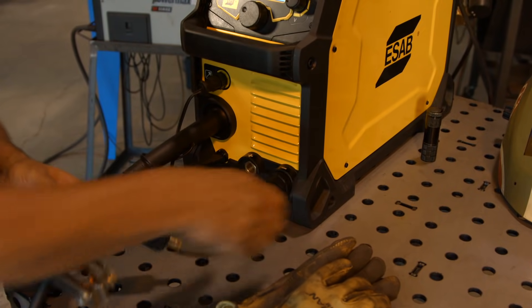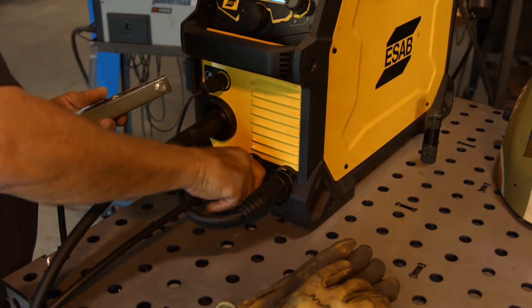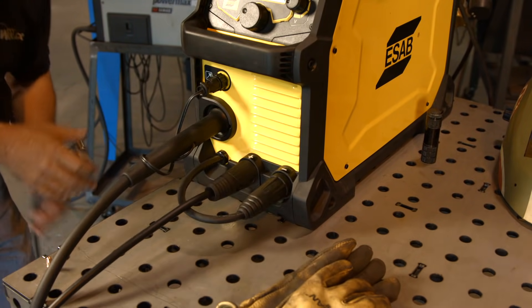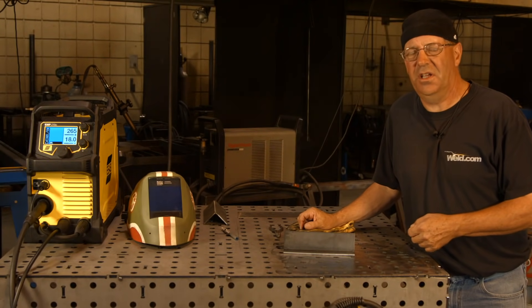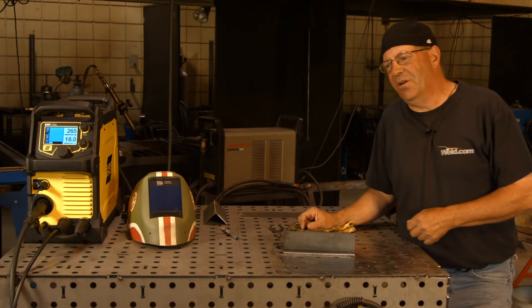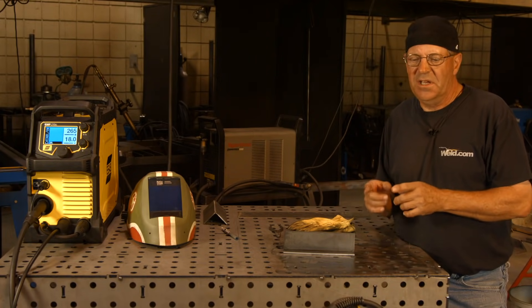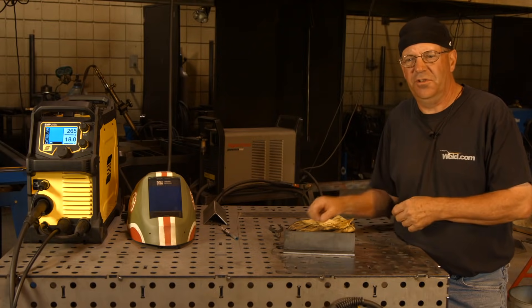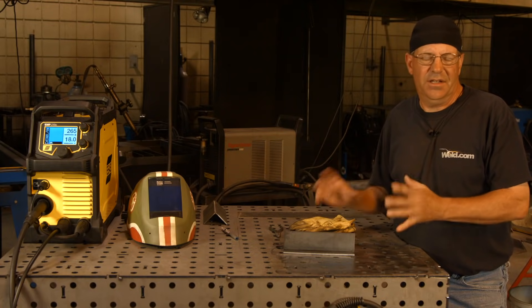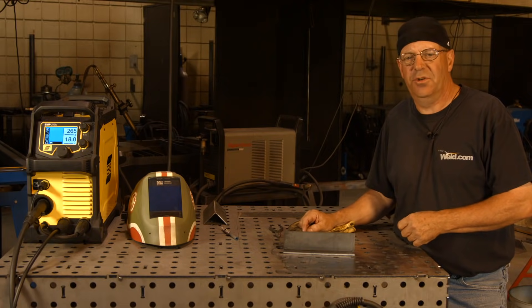I've been called out a lot on this. A friend of mine called me one time and said, 'Man, I got this little welder, I have a gasless flux core wire, it doesn't run worth a poo — it's bad, couldn't get it set right.' I said I'd be over in a few minutes. Walked in, saw where his machine was set, and he actually had the bolt lugs on the inside of the machine where you change the jumper wrong. We fixed that and it worked perfect. So again, change it to DC electrode negative.